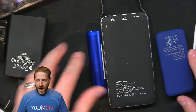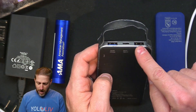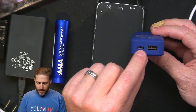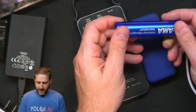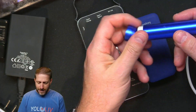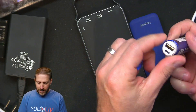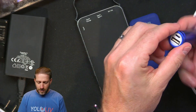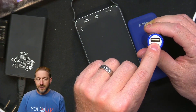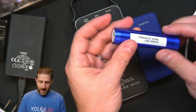I have three batteries here. This small one is just one of those giveaway batteries — a single lithium-ion cell with a little bit of charging circuitry and a single USB-A port. With that construction, this is probably one amp of power maximum. You're not going to pull 2.4 amps, and you're definitely not going to pull 3 amps out of this.